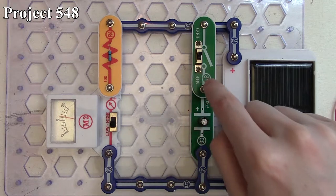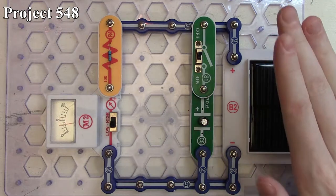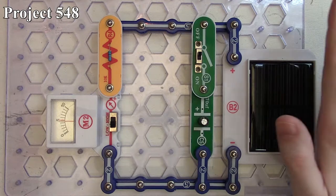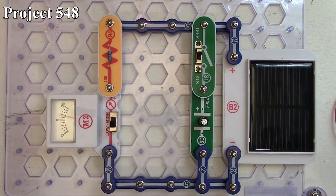We have a switched C5 capacitor — 470 microfarad — so the energy from our solar panel gets stored in the capacitor with our switch set to the on position. We have our 10,000 ohm resistor feeding our meter, which is connected with the solar panel and capacitor. Right now the capacitor is not in the circuit because we have it turned off, and you can see some current flowing through our meter as our solar panel takes ambient light and converts it into electricity. Covering the solar panel reduces the amount of electricity going through our meter by limiting the light entering the solar cell.